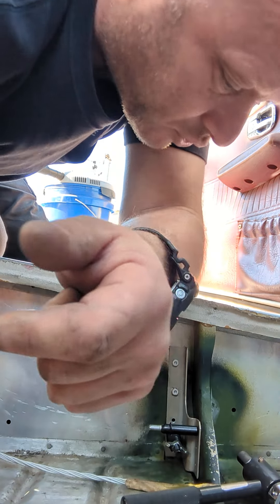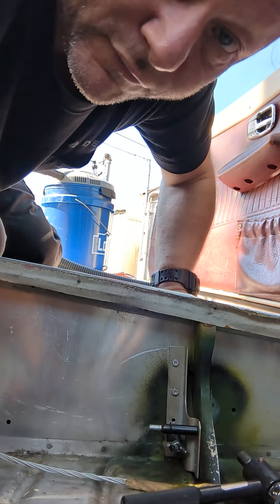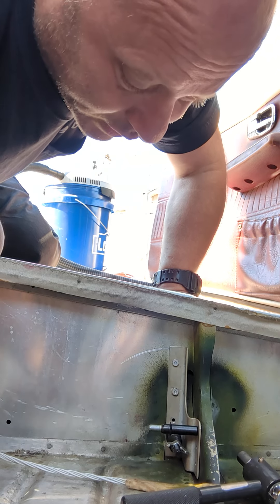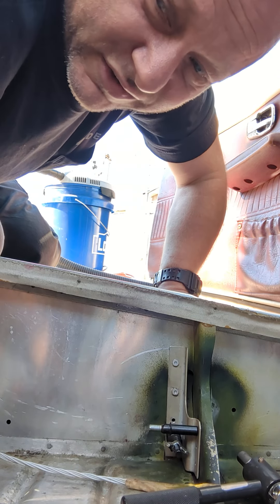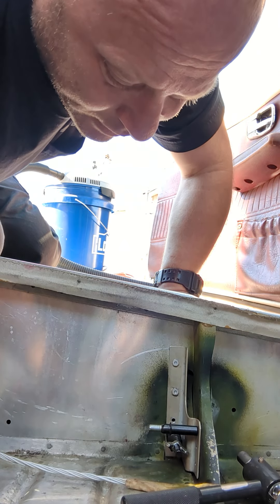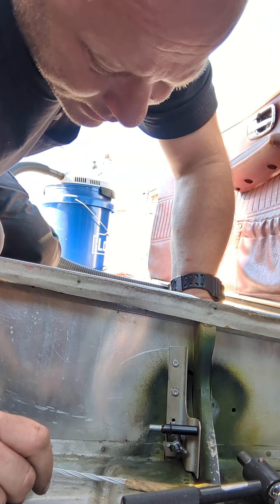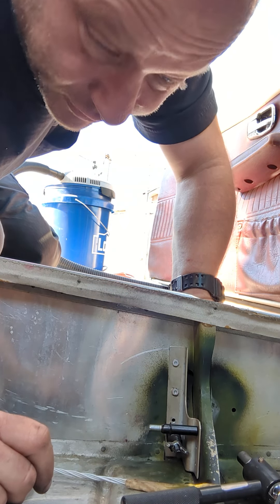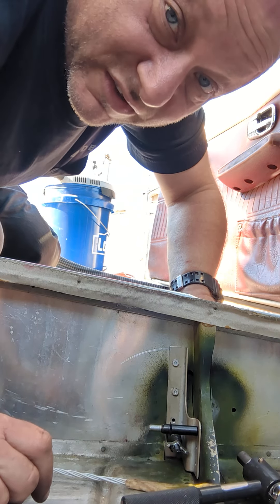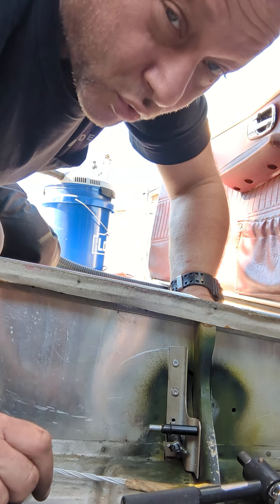Pretty cool. A couple of people have videos out there about the flush style fasteners, but nobody had any about the ones that look like bolt heads. These are Dash 8 — they come in different sizes, something pretty close to rivet sizes if not exactly. They are structural. I'm working on a forward wing attach point here on a Beechcraft. They seem to work pretty good. Hope this clears it up if you ever have to put one of these in and you've never seen one before, because this is very much a Beechcraft thing — I don't know who else uses them.